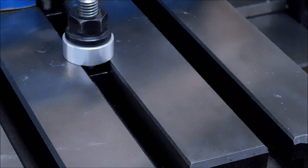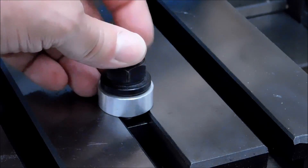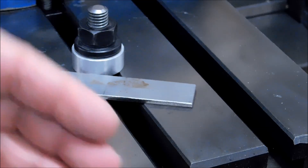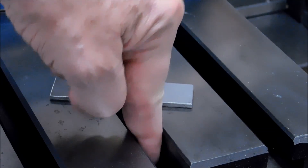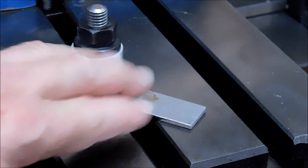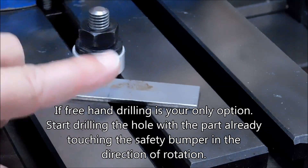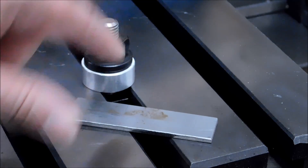This is probably the easiest and fastest way to stop rotation on any part you're going to freehand drill on a table: just put an anti-rotation plug, which is simply a T-nut with a piece of all-thread. I have an aluminum collar and a nut. If you're going to be drilling the piece, this is one of many options — certainly not the safest, but a step in the right direction. You want the material, when you drill it, to naturally go down into the hole or between the ways on your machine as it wants to turn. Make sure it's going to bump up against something. Don't make the mistake of keeping your fingers anywhere in that vicinity as you're drilling, because as it spins it's going to pinch and bite a piece out of you. Keep something in the way to prevent rotation.